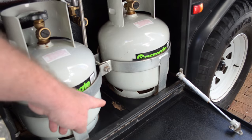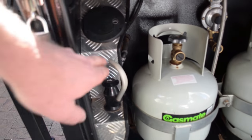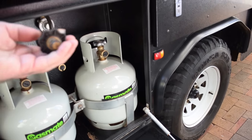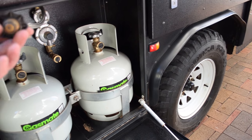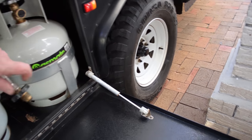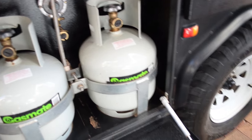The next cabinet is our gas cabinet. These clearly have to be vented — as you can see there's a vent down there, so you will get dust in them. It's also our primary drinking tank filling point and has a manual pump in case the electric unit fails. I recommend that when you disconnect the gas fittings, put a small bag over them with a zip tie to prevent dust from getting in and choking them up. Same with the bayonet fitting — leave a little bung in to prevent the system from clogging.